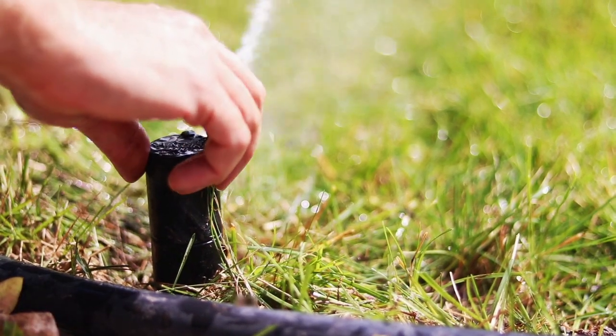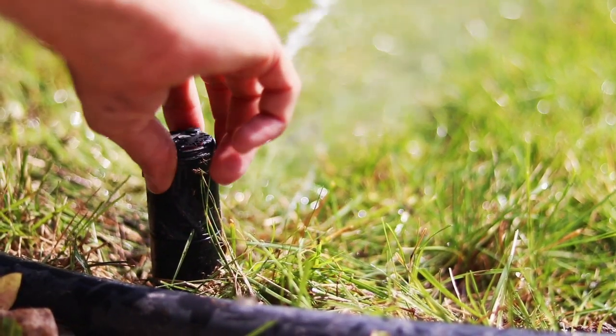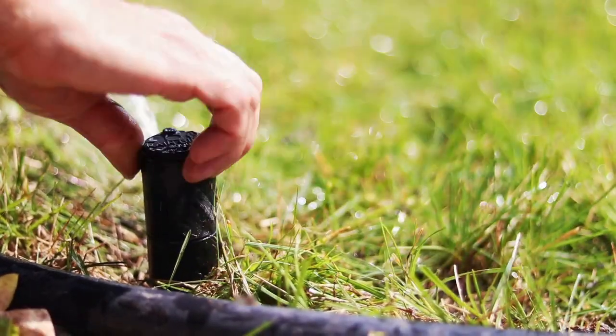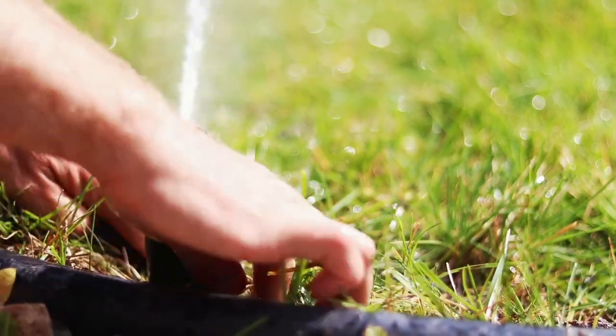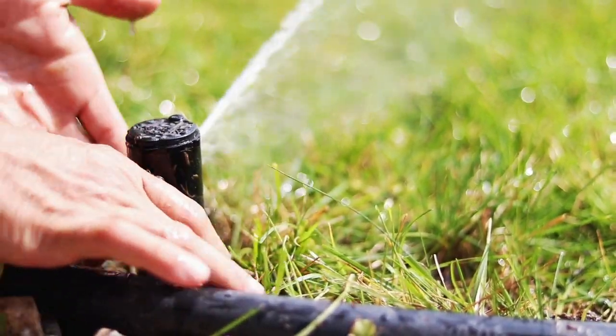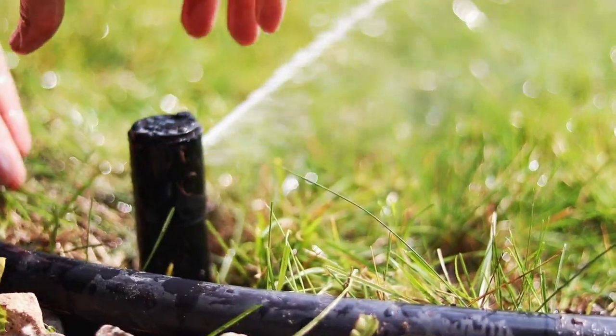It's an old head so it's not going to have a slip clutch working anymore. You can tell by doing that gently — and nope, it's not slipping. So the only way to set the left stop on a Rainbird head is to turn it in the ground or take the cartridge out and pick it up and move it in the ground.